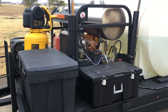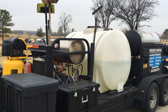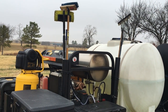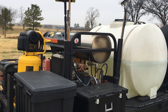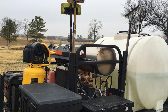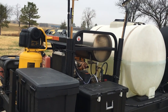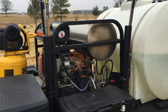Now let's get to the machines. This trailer has three pressure washers, and they're all Landa brand. This first one is a Landa PGHW — 5,000 PSI at 5 gallons per minute. This is an excellent machine for surface cleaning. It's not so much the water volume that matters here; it's the pressure, which is your scrubbing action — the more pressure, the better the clean. I'll hook up my big surface cleaner to this machine. It can also do hot water.